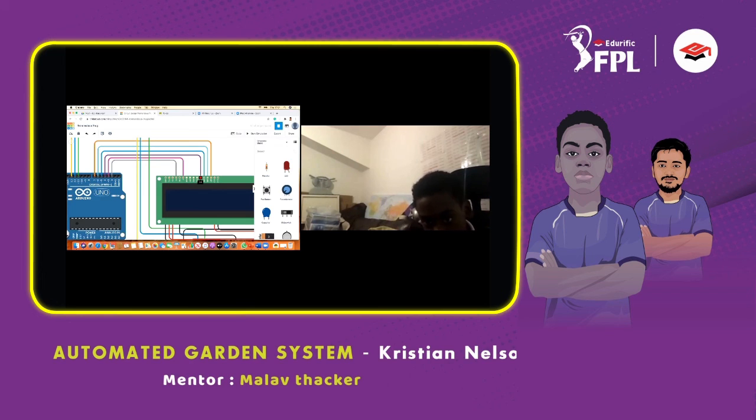This is DB4 and it connects to the Arduino on the number 4 pin. This is DB5 that connects to 5 on the Arduino. DB6 connects to the Arduino on number 6. And then DB7 connects to the Arduino on number 7.